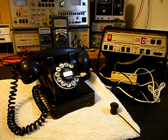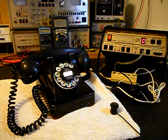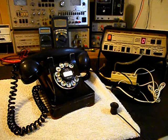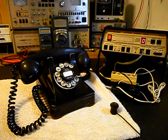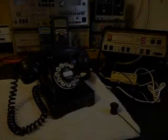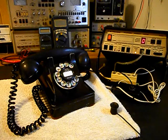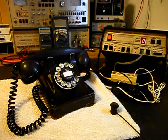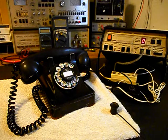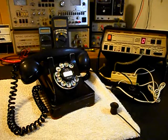I'm going to go ahead and press the button — you may hear a little bit of an electrical hum. It is pretty quiet today, but if you hear any noise during the final checkout, it will be coming from the amplifier and not the telephone. I want to go ahead and use the analyzer and send a ring cycle like you were getting a call. We're going to let that go a few times, then give you some dial tone.